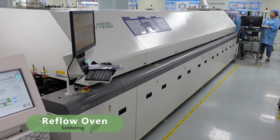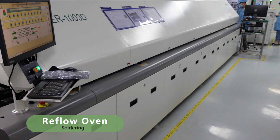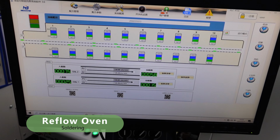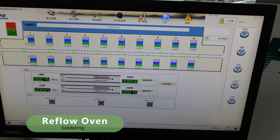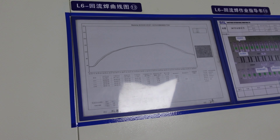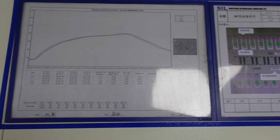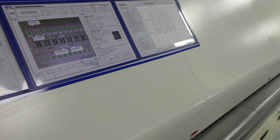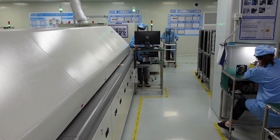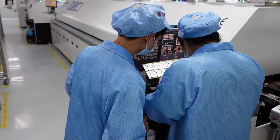After all electronic components are mounted on the PCB, the next important procedure is to make the PCBA fully functional. This process is done by placing them into a reflow oven. To successfully solder surface mount components to a circuit board, the heat should be transferred to the solder paste until its temperature reaches a molten point. The liquid alloy will merge with the PCB copper pad and become an alloy mixture. A solid solder joint will be formed after it cools down below the molten point.